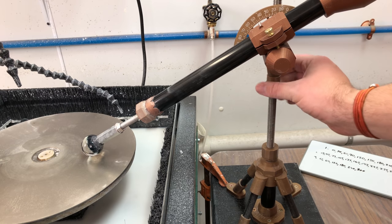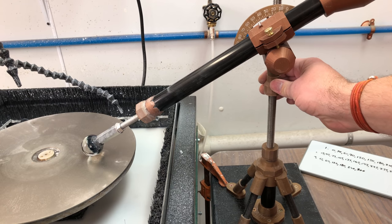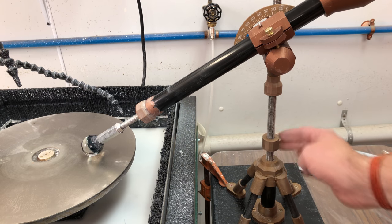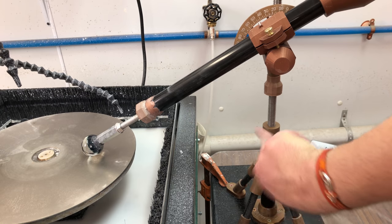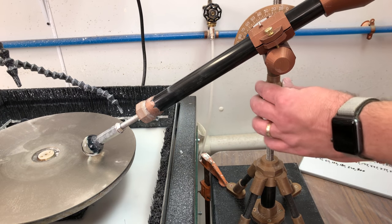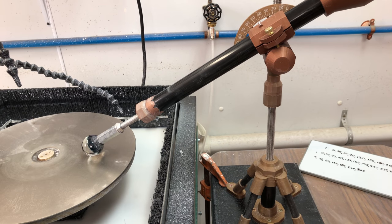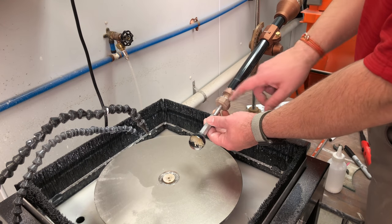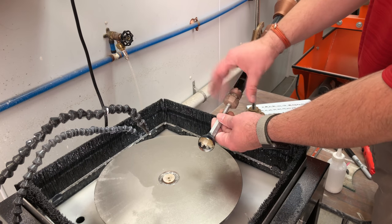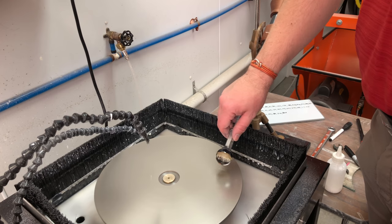I'm checking my height and face angle — I'm actually at about 45 degrees, so I'm going to leave it there. Now that I have that at 45 degrees, I'm going to take my lock screw and move it all the way up to lock it in place. I don't want my facet arm to shift as I'm working and change my facet angles. The first thing I'm going to do is loosen up my angle selector lock and make sure I'm starting at the correct degrees — this time at 15 degrees instead of 0 degrees to have an offset 12 facets. I'm going to do the exact same number of swipes again, starting with my 15 degree angle.